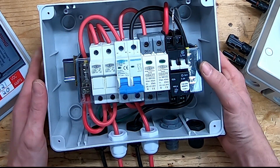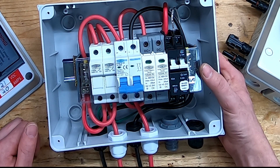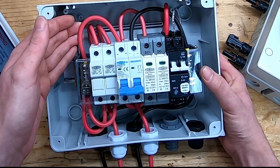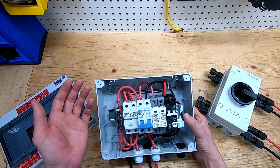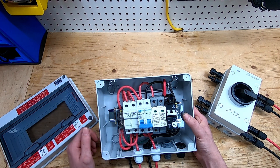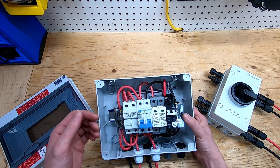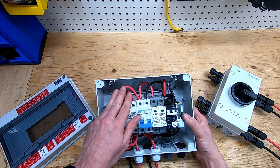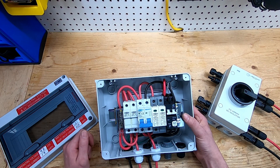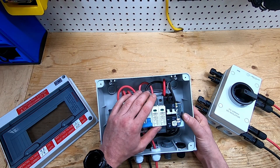Pretty simple — all these parts were sourced on AliExpress and I'll leave links in the description. I think this build turned out rather nicely. All these cables here are PV rated cables. When I purchased my 310 watt panels, I asked some employees at the store if they had any solar wires or branch connectors from other jobs they no longer had a use for, and they said sure. These are a little sun beaten already, but since they're inside the box and I'm going to mount this underneath my array, they won't be seeing the sun or rain anymore.